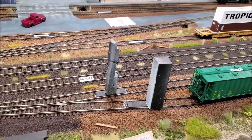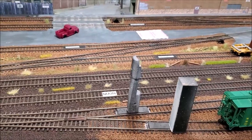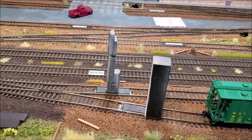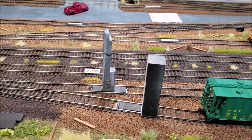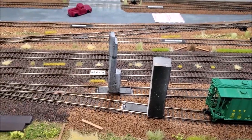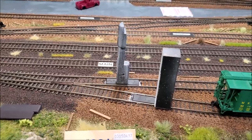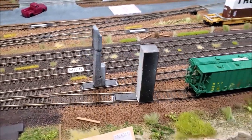With one switch we've had to pull up because of a problem with the switch and fix it and then put it back in place. You know, we just literally soaked the switch, and when the ballast all got loose, then we just vacuumed it all up. Then we cut the switch out, repaired the switch, and put it back in place. But anyway,